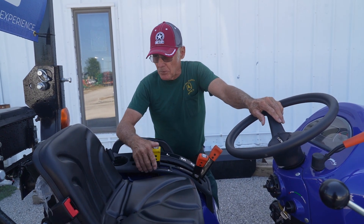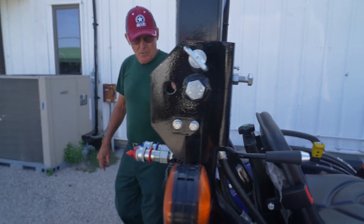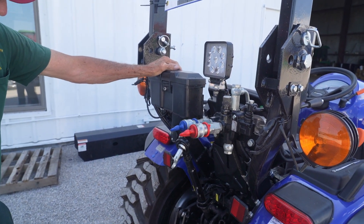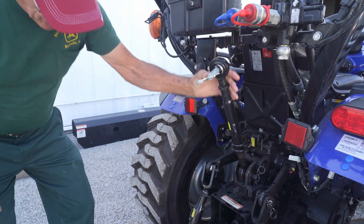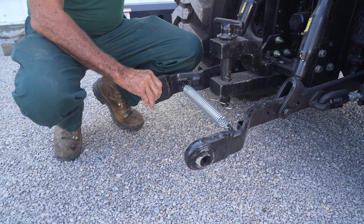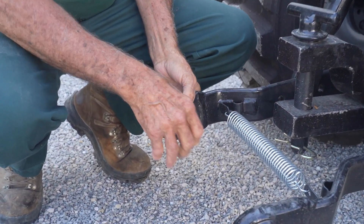You can run in two-wheel drive or four-wheel drive. Going around the back of the tractor, we've got one dual hydraulic outlet that comes standard. There's also a toolbox. Standard category 1 or category 2 three-point hitch — all you do is reverse the balls, so a lot of people with a mixture of equipment can use either one. It'll work with either one, along with the drawbar.